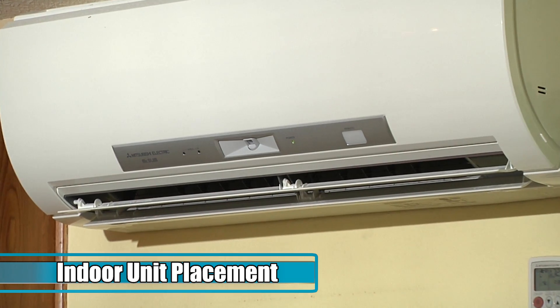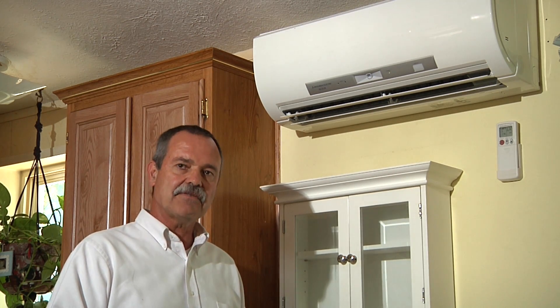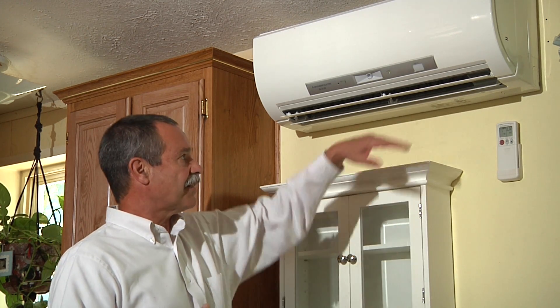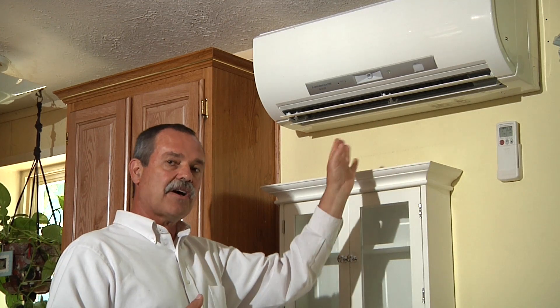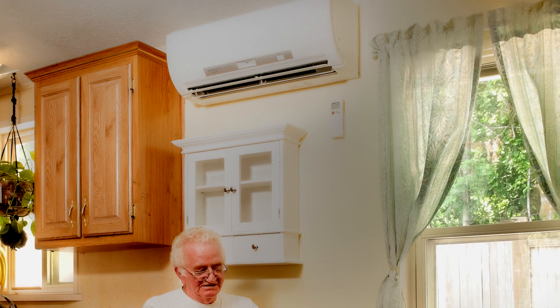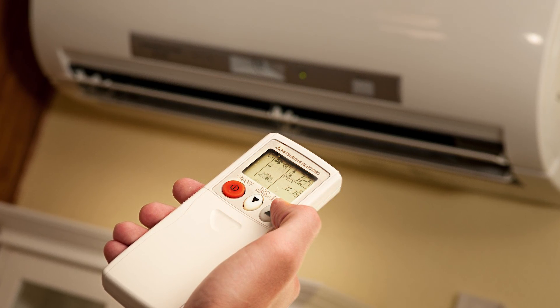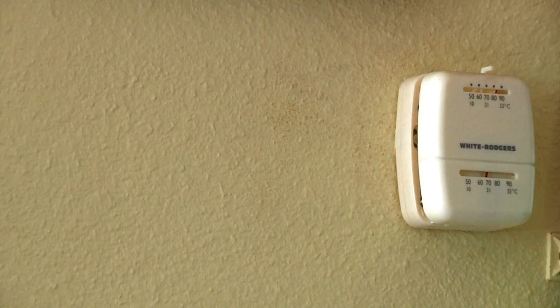This is the interior part of the ductless heat pump, often called the interior head. Its job is to distribute warm air in the winter and cool air in the summer. It has a powerful but very quiet and efficient fan. The fan itself is adjustable so you can adjust it to your own comfort needs — many models have blades that go up and down and in some cases also back and forth. The location of this unit within the manufactured house is very important. Locating it in the main body brings the majority of the house into play. Equally important is to make sure it's not blowing directly onto the thermostat that controls the electric furnace — in this case the thermostat is safely away from direct currents coming out of the interior head.